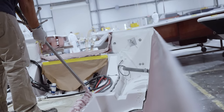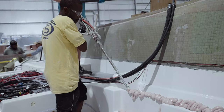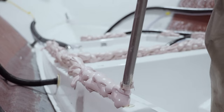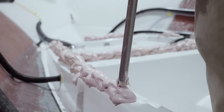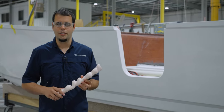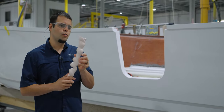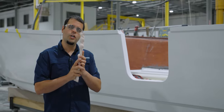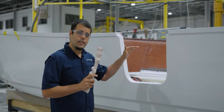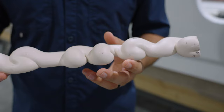The technician will apply a 2 to 3 inch bead of bonding putty, very similar to the putty we saw in the hull lamination episode. Let's take a quick look at our bonding putty in isolation and contrast it to our methyl methacrylate. This bonding putty is what we use to adhere the deck to the stringer.